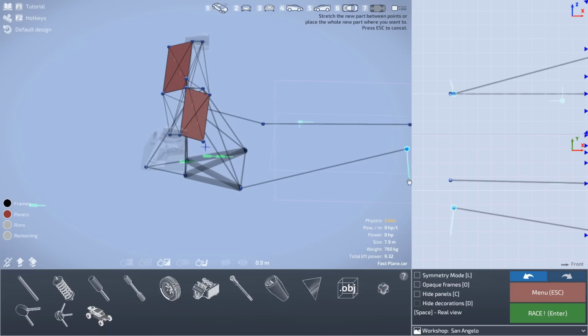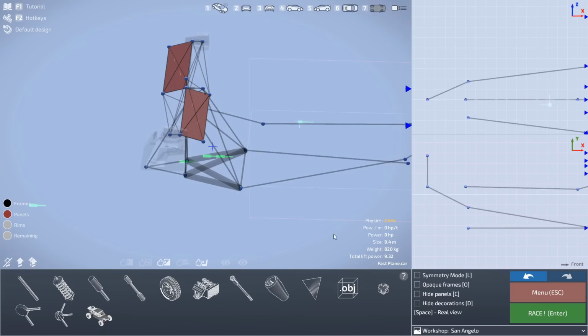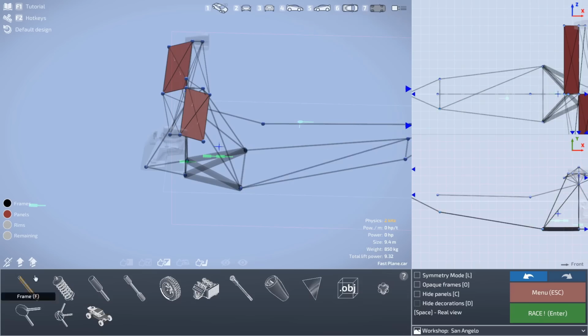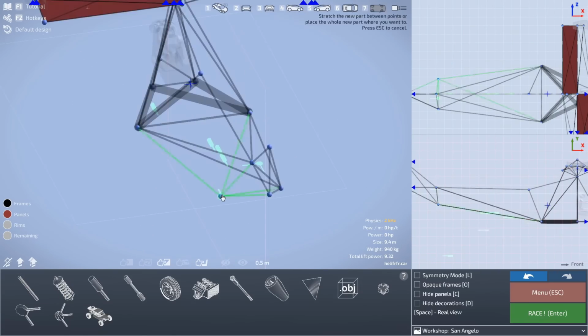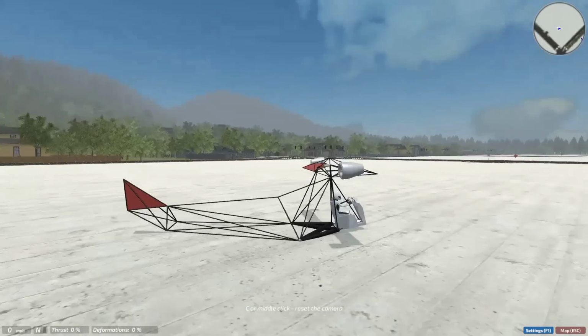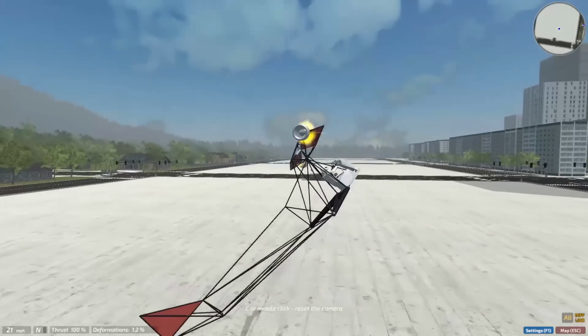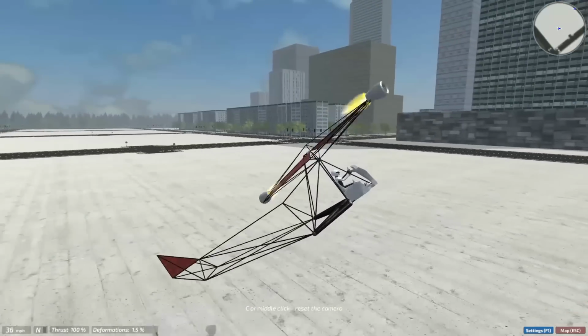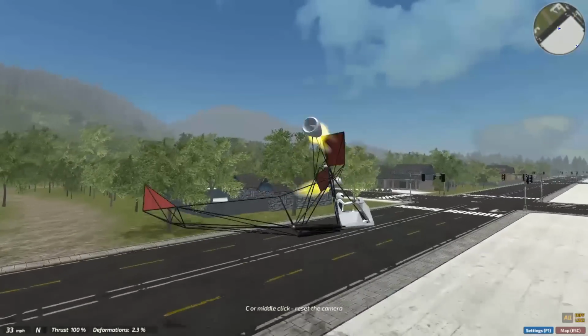I did this for, I guess, three main reasons. The first one is I wanted to get a stabilizer in the back so that it wouldn't want to move back and forth as much, or I guess what would it be, yaw back and forth as much. The second thing I wanted to do was add in a jet to the back, and eventually this is going to be what rotates the helicopter around, and I can choose what orientation I want to be pointing in. And the third reason is it makes it look more like a helicopter, so I felt like I kind of had to. It's a little tail heavy at the moment, which is kind of funny because I built the tail.